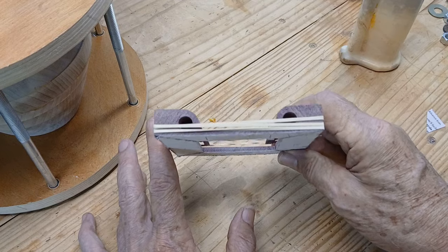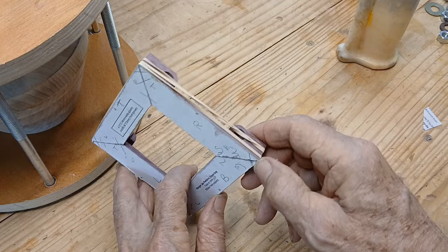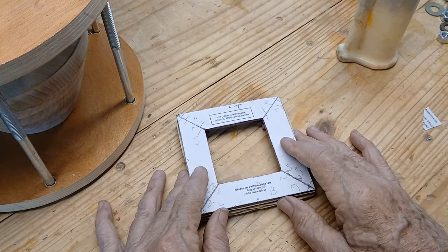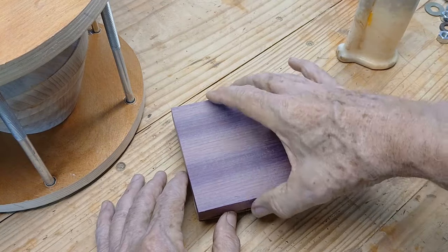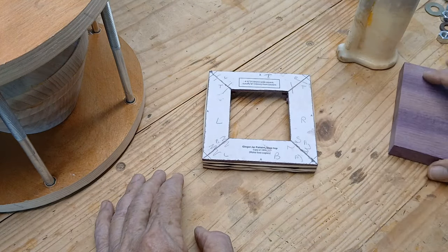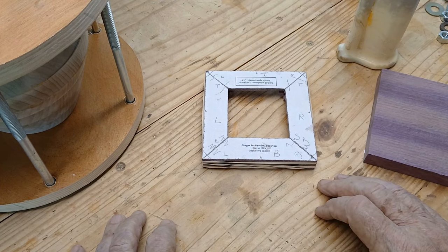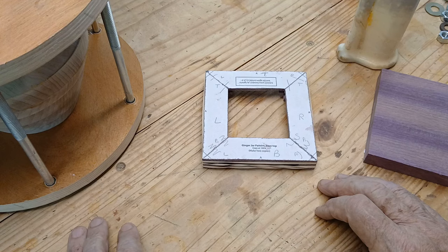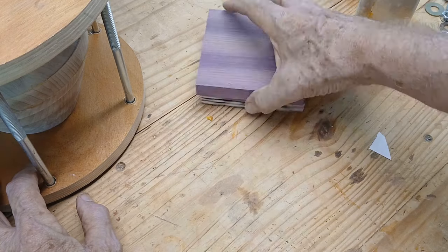All four pieces are cut and glued together. I've got that little line to cut off and then I'll sand and smooth it around. There's only one more cut after that — using the bottom of the jar to mark the base piece, then cutting it at an angle so it sets on top and the jar sits on top of that. The rest is sanding, then gluing. I still need to shape the jar itself — I'll take it out of the press and go over it with a flexible pad sander; there's a lot of material to move.